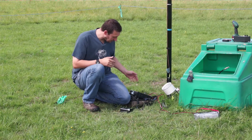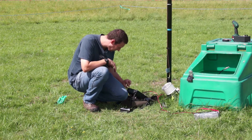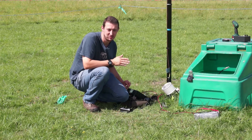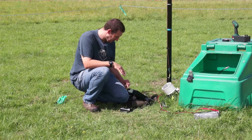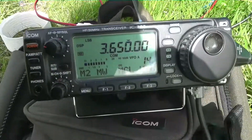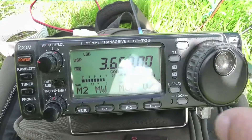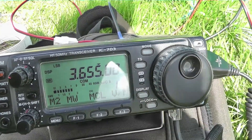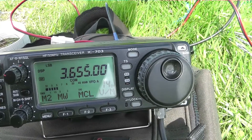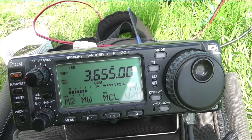Right, so I've got a radio hooked up — an old ICOM 703, a lovely old radio. I found a couple of people in Curacao on 3650. The band is a little bit quiet at the moment — perhaps not quite the right time of day — but there are people on there. So 3650, getting a good signal. I'll go slightly off frequency so I don't interfere with them — 3655 — and I'll key up and check the SWR. 'M0GQC test.' You can see we were getting about an SWR of 2, maybe just a tiny bit under.